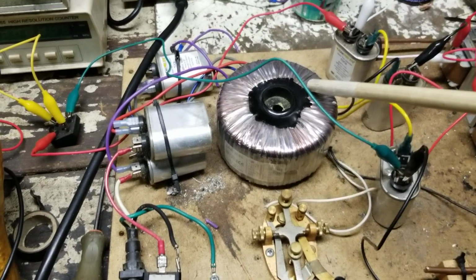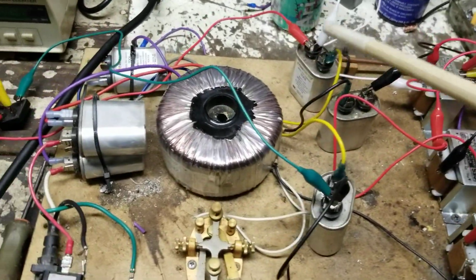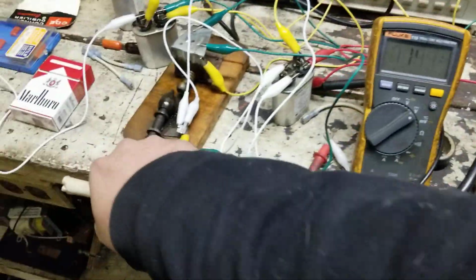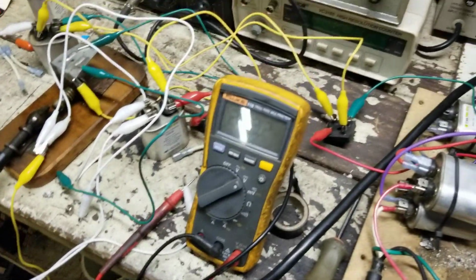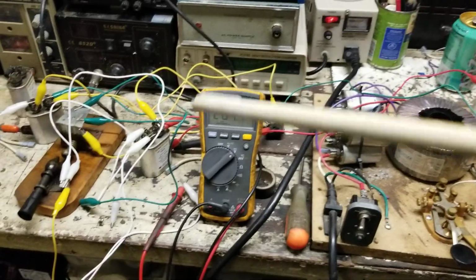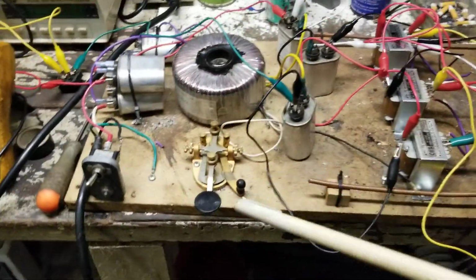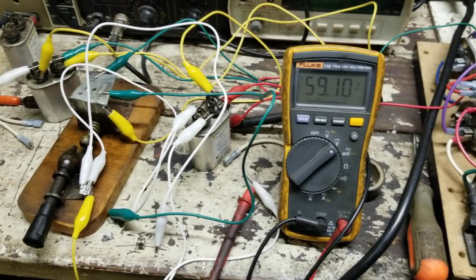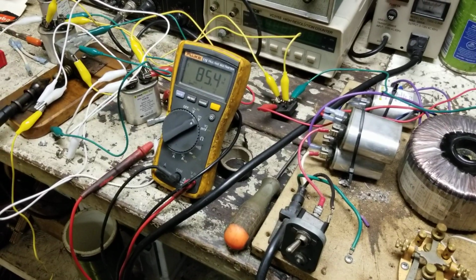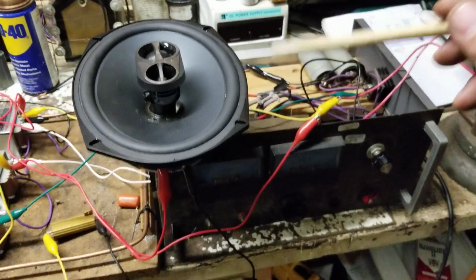should effectively be 22, but in reality what we're seeing without any reaction going on is upwards of 80 volts, as we saw in the rest state. Or that's not the rest state. Alright, I can kill it by taking the variac all the way down. Turning it off and on abruptly is enough of a spike that it keeps it going most of the time. But anyway, at rest, we'll discharge, and 60 volts. 85 when I turn this knob all the way up to the highest voltage tap on there with the switch off.